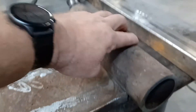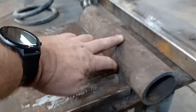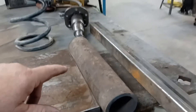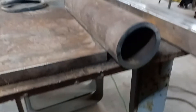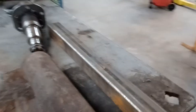This tube is going to get welded to this flat plate, and I'm going to weld it on the bottom so it's down low like this. I'm going to put a bead across the top, tack it first on both sides, flip it over, run a long tack on the bottom side. Then I'm going to put a bead on top and fill that seam pretty much on the bottom side. That's going to be where my spring will sit.